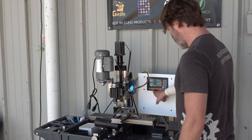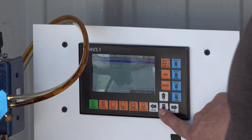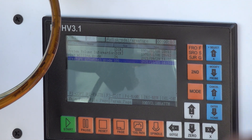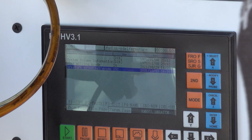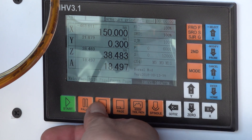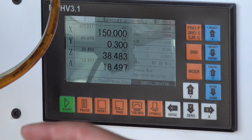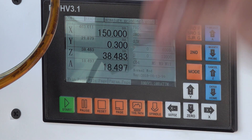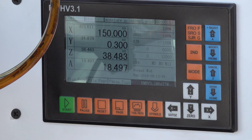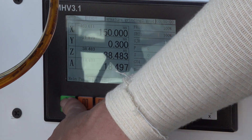Before I actually do it, I just want to show you the operation. We pull this out, then we go into our page screen, scroll down to armature grinding number two G-code — because that's the latest one that I did — and hit enter. We need to reset the machine, because usually it's got the e-stop on when you first boot up any sort of controller. So we essentially hit the e-stop, which is the reset button, and then we hit start and it does its thing.